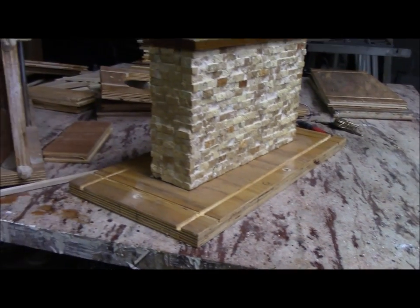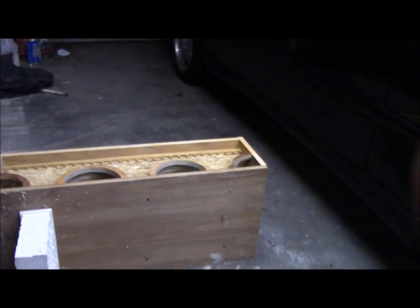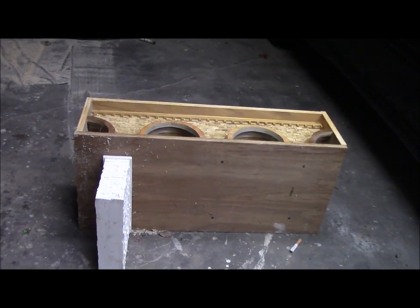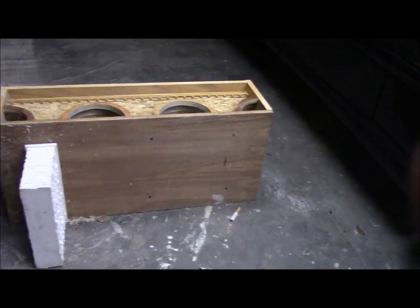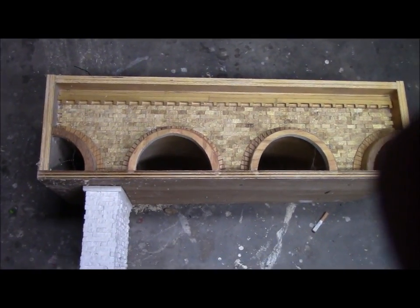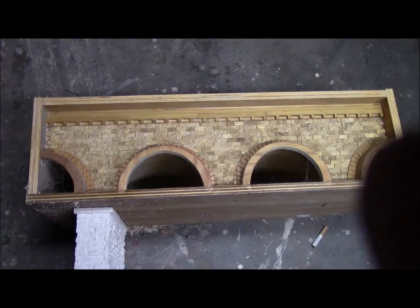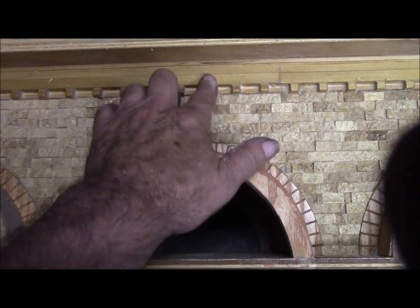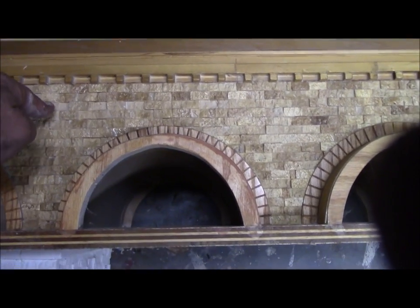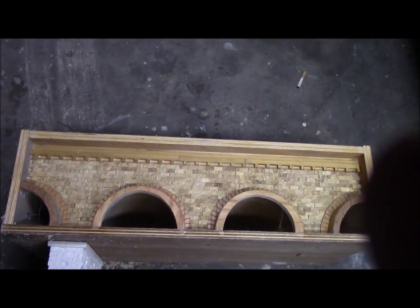I'll provide another picture so you can get a better idea of what it looks like properly set up. That's what I'm going to be doing for the next three or four days. I already have three molds ready to go to pour the urethane in. Then I have to work on the pattern to make a mold for the two large sections. I'm going to try one without rebar in it, let it set for about three days, and see if it cracks. If it does, I'll put two sections lengthwise of three-eighths rebar, and that will solve that problem.